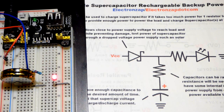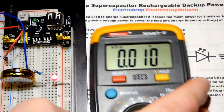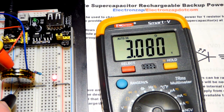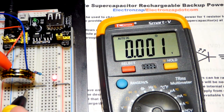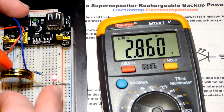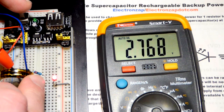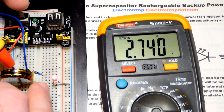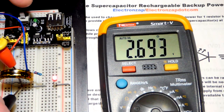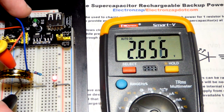There's one tricky thing when a capacitor has internal resistance: when you're measuring the voltage across it, the internal resistance acts like a voltage divider. Right now we have this resistor and LED going to ground, and you can see the ground rail is connected over to the super capacitor. We've got 2.8 volts — more than the 1.6 volts we need for the LED. It's dropping because it's discharging through the resistor and LED. As you take current out of a super capacitor, its voltage drops linearly based on how much current comes out.